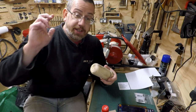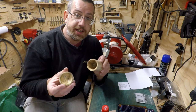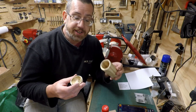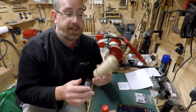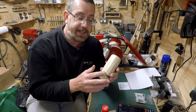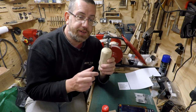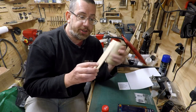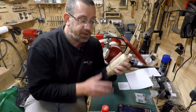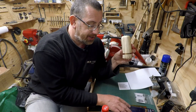This is the first box I rough turned on that video two weeks ago. Yesterday while I was out here finishing up I decided to finish this off. The inside is finished, sanded to 600, with sanding sealer and a couple of coats of Wood Wax 22. The outside I've just sanded to 600 and left it as is. Some of this is going to be experimentation, and I've got a scrap piece of plywood to experiment with the pencils first.